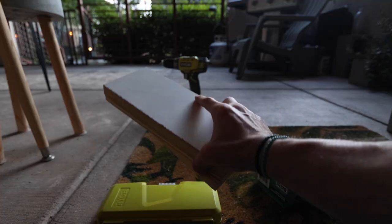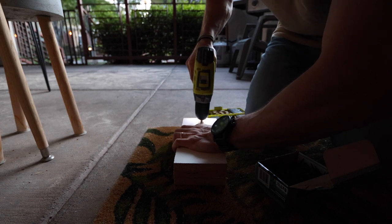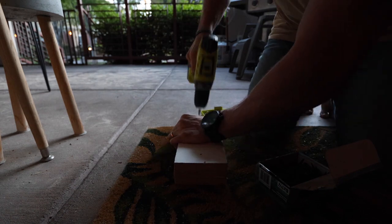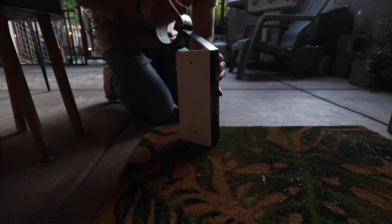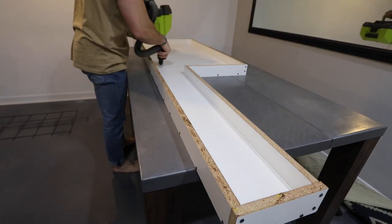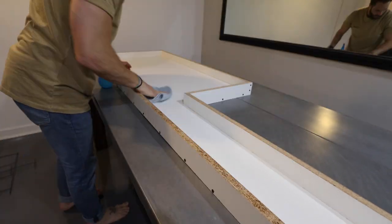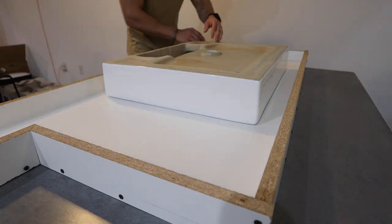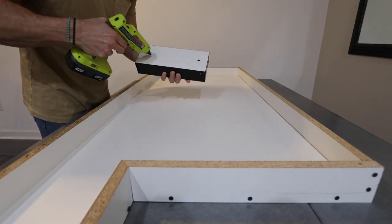Now I needed to make a spacer for where the faucet lines and drain pipe would come through the countertop. For this I screwed together two scrap pieces of melamine with a half inch scrap piece of wood in the middle. This will give me a total of two inches which will be the thickness of the countertop. I made sure to use smooth tape for the edges so it would not stick to the concrete. I gave the mold a good vacuum and wiped it down with some TSP solution just to clean it. Next I traced around the vessel sink so I had a better idea of where the drain pipe and faucet lines were going to go. Then I could hot glue the spacer in place.